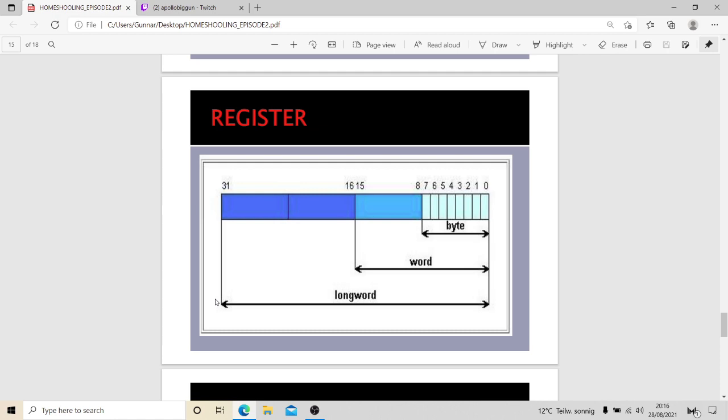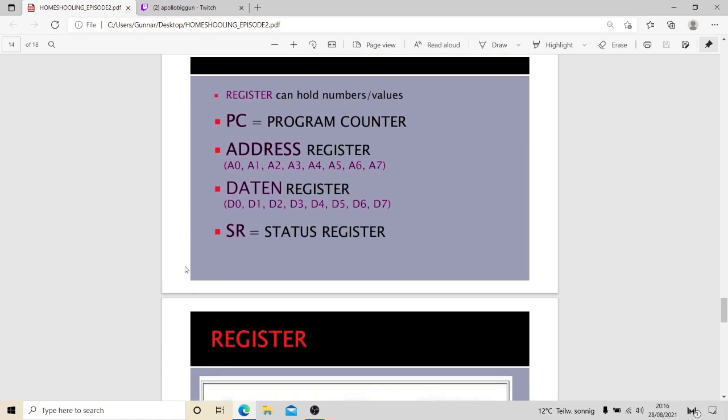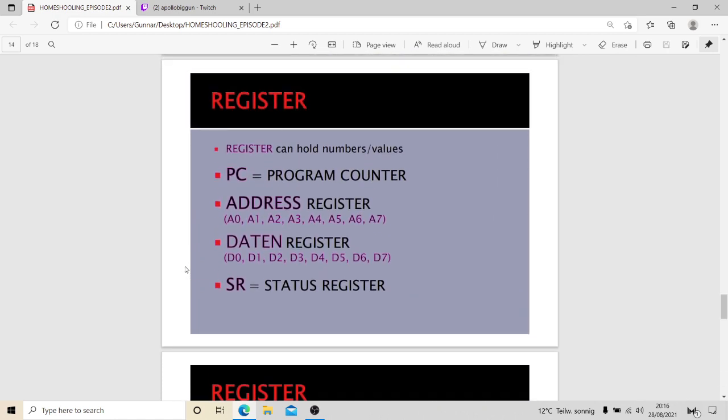The 68080 does change a few of these things. Let's quickly go back. Of course, the 68080 has an instruction counter, a program counter. We need to know where our instructions in memory are. So this is the same. Address registers, 8. 8 address registers is actually a pretty luxurious situation. Normally, 8 address registers last you forever. Sometimes you want to do stuff rarely, but still sometimes where 8 registers might not be enough.